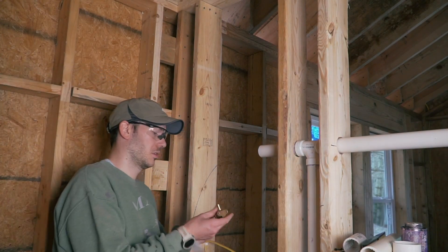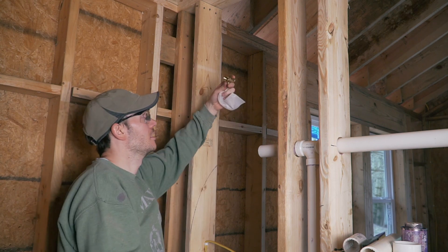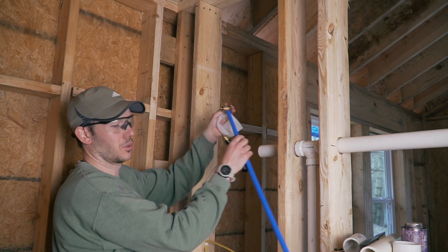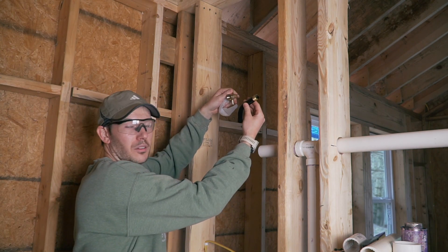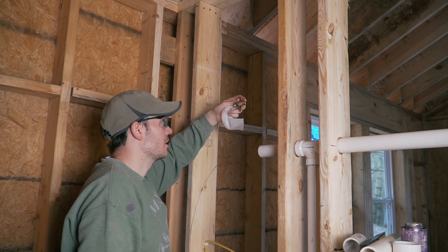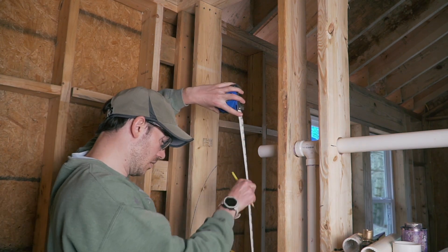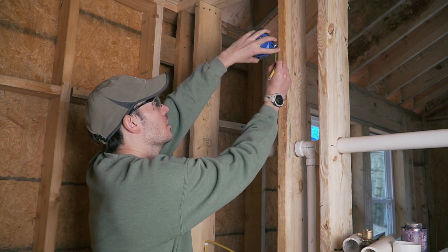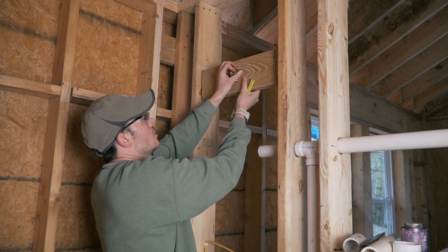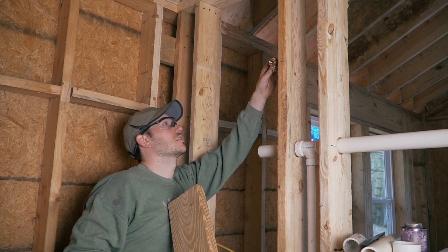I still need to put a piece of wood here for where I'll have my shower head. This time I'm learning from my lesson — you can see I got the right attachment at the bottom. This was absolutely going to fit half inch, so we're good. I'm just checking my shower kit to make sure it's also correct because I'm tired of making those mistakes. We're good to go. The height will be 78 inches. I think you can flush it with the stud — I think that's good.